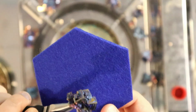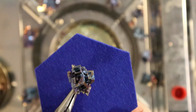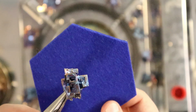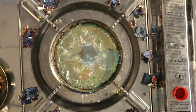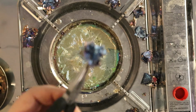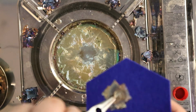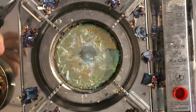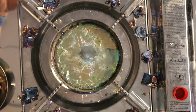So maybe this is an approach I will try again, which is adding some copper wires to the top before turning it off so that they get up to temperature and then act as sort of heat sinks to create not a thermal shock, but just a gentle cooling that's faster than the metal around them. Although, pro or con, I'm not sure, it's got a wire stuck in it that I could melt out if I melted this, but that might be worth saving for a while. Let's put it where we can see it.